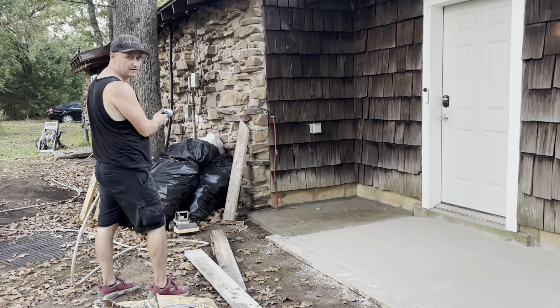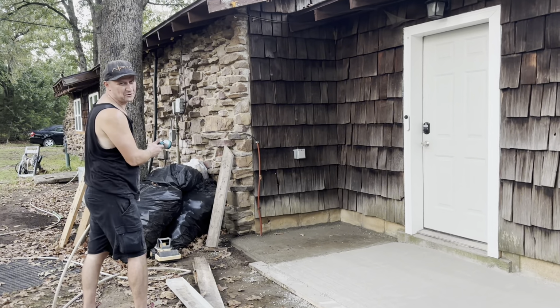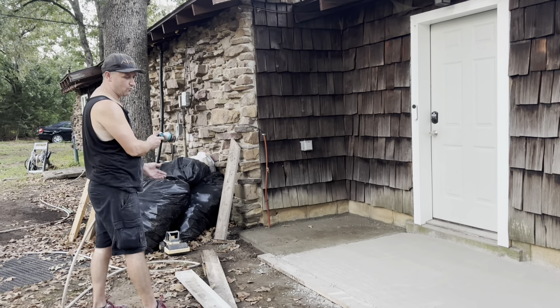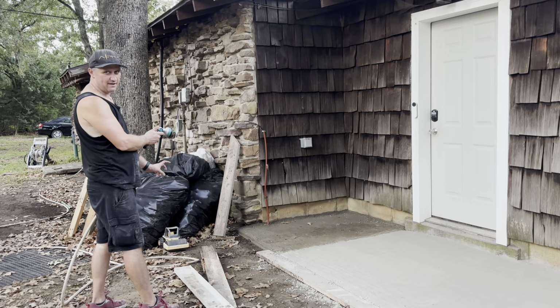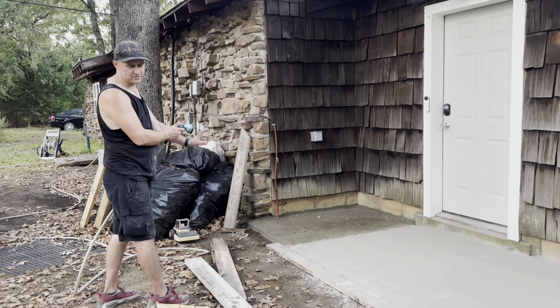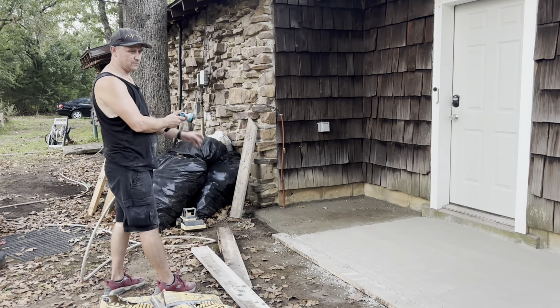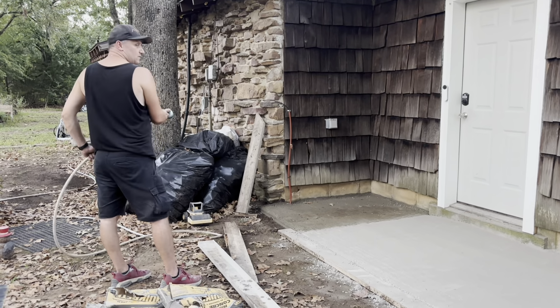We come back between 30 minutes and an hour, depending on how thick the concrete is. Like I said, we're probably inch to inch and a half range here. It's probably more like inch and a half to 2 inches because of the depth, sorry. Because a tipped over 2x6 like this is inch and a half, so we'll give it a shot here.